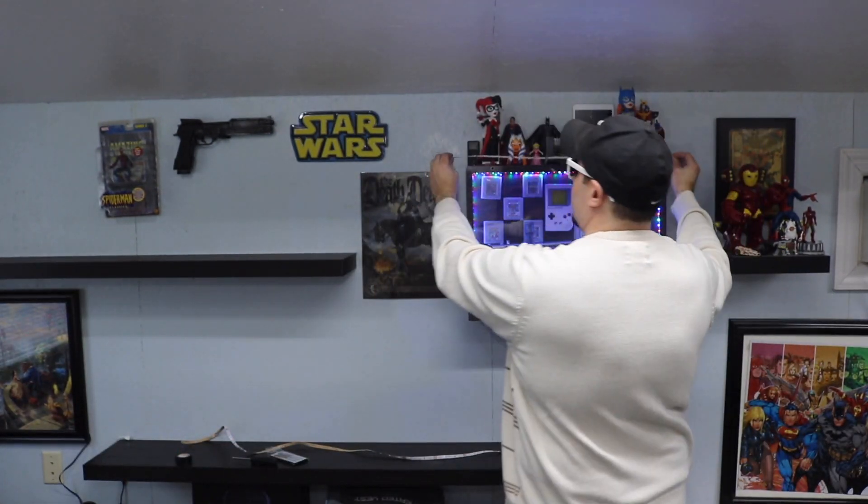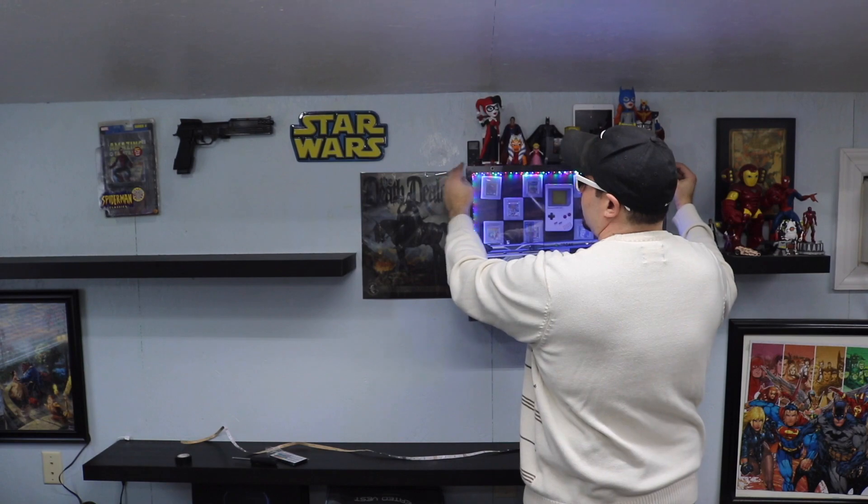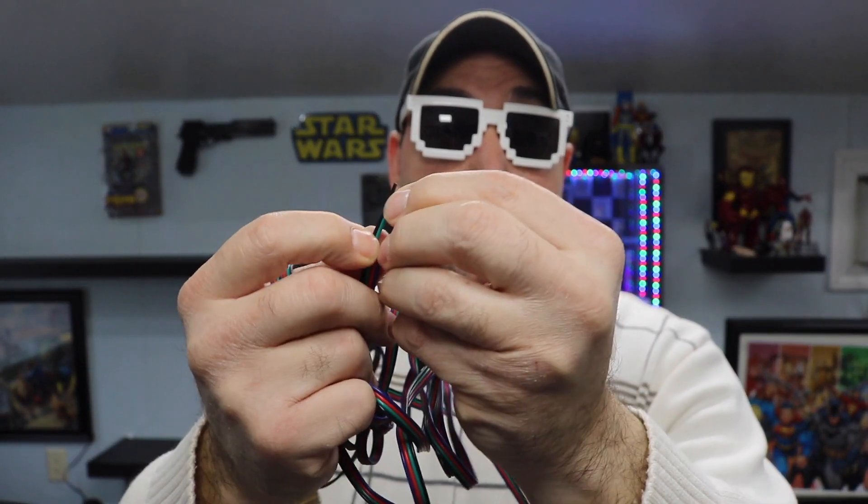Some of them are a little shorter, some a little longer, but the point is you will get them all lit. This light strip is supposed to go across the top of this right here, and as you can see it comes off a little bit. I could go shorter — I don't want to. So I'm going to let it go off to the side a little bit and give it a lighting effect. I think it'll be fine. If not, I can always cut it shorter. Looks like it's in spans of four inches. Let's get over to the soldering station. This cable is what we're going to use to attach it — it has the 12 volt which is the black, and then green, blue, and red for the individual colors. It does white as well by combining all those colors together.